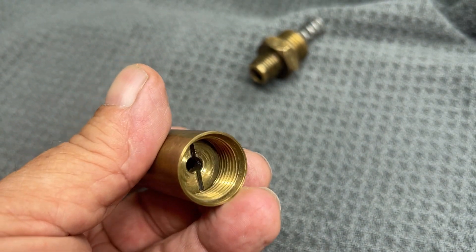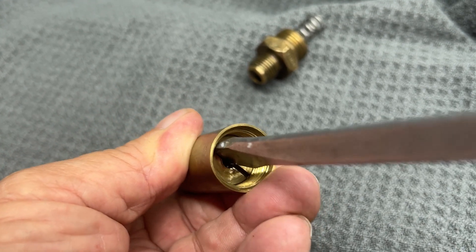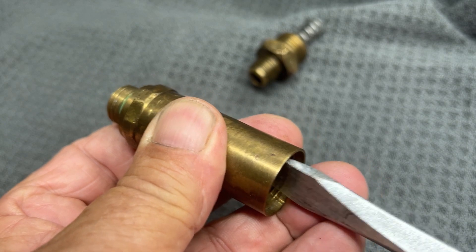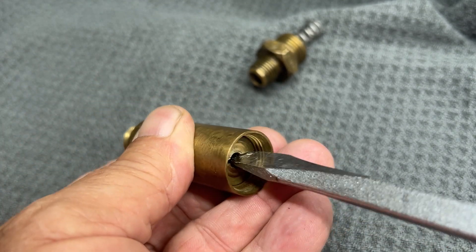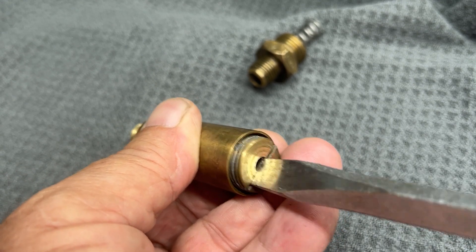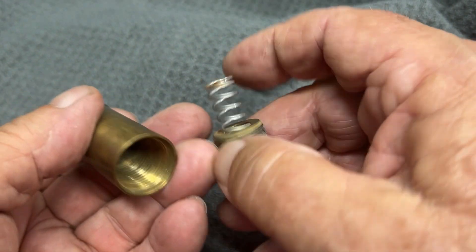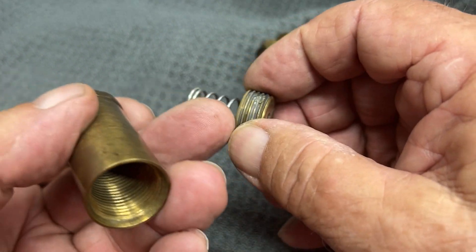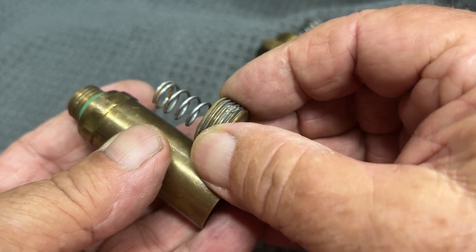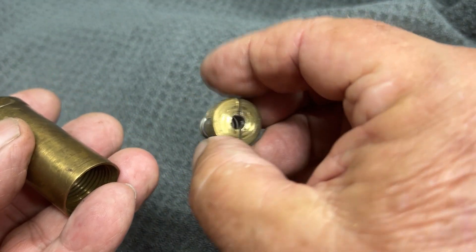This spring here is only to hold the adjustment. Some designs require shims to increase the pressure, but this one is different — it's actually threaded, which makes it really handy. When you're adjusting it, you can just tighten or loosen it to increase or reduce the pressure that it activates at. You can change the spring to a heavier or softer one. Crank it up tight and it doesn't release until high pressure; back it off and it'll relieve pressure at a lower level.